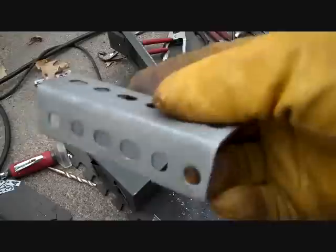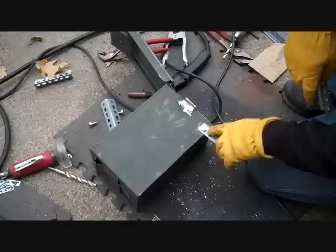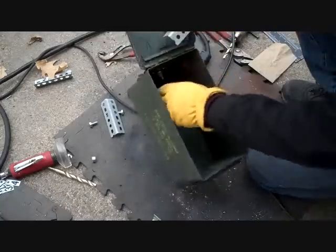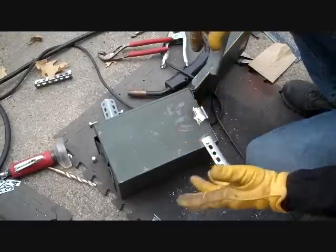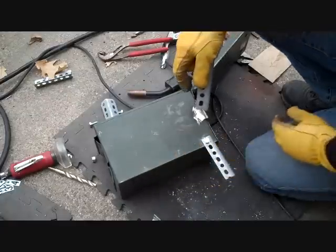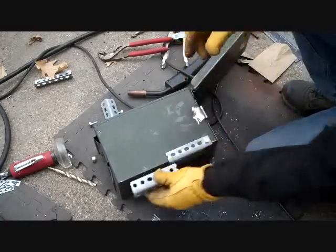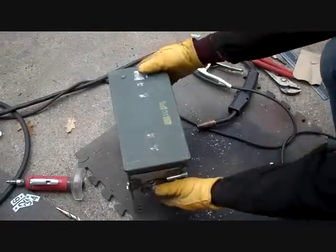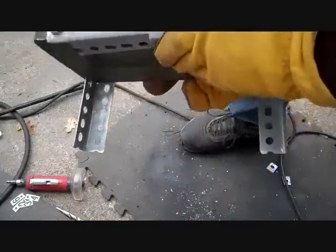For the legs, I'm just going to cut out some of this channeling. I want them to be able to fold up underneath, so I just use a bolt — a little bit longer bolt because I'm going to use the extension inside to lay a grate on top. The bolts will actually support a grate on top as well. You don't need a grate, but it helps extend the life of the stove because the fire's not sitting right on the bottom. These will fold up underneath.